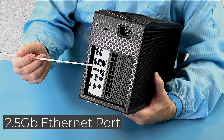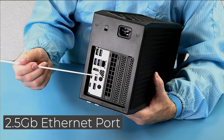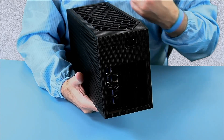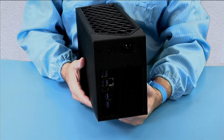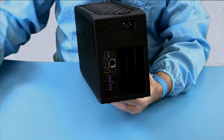There is a 2.5 gigabit Ethernet port and two antenna holes if you want external antenna connections. I have put on my anti-static smock, my wrist strap, and I have an anti-static surface. It's important anytime you are dealing with sensitive electronics to prevent any static discharge.